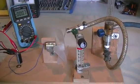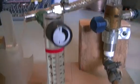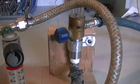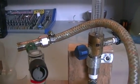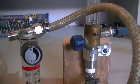Here's our current setup, much the same as the last setup, only this time we have a flow meter on the input and a flow meter telling us how much is being drawn through the venturi. I'm limited to 4 litres a minute on that flow gauge; this one here does 5 litres a minute, both calibrated for oxygen. Our supply pressure is still around 5 psi — hard to be completely accurate with an analog gauge — and our nozzle inside has a hole of 1.6 mil.